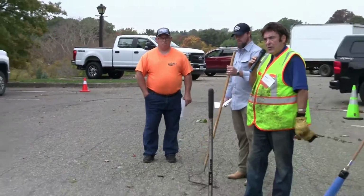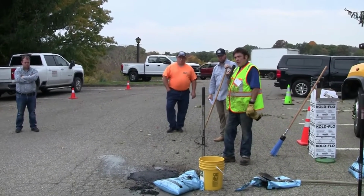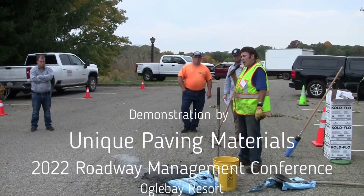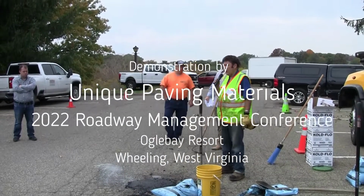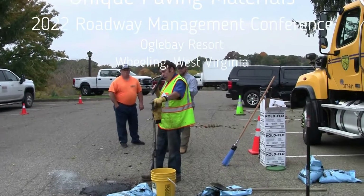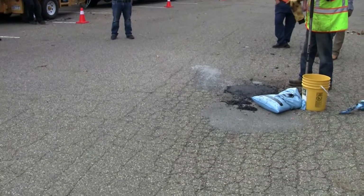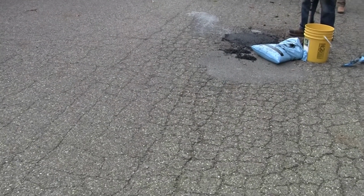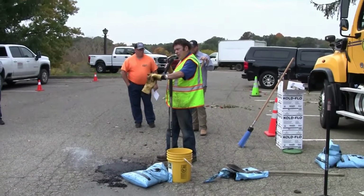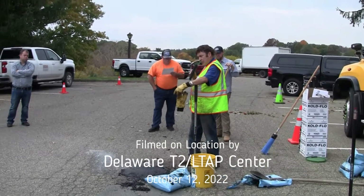Questions on workability, finishability, survivability. For those that want, I've got samples of the cold mix for you, a few bags. I've also got samples of cold crack filler, and also a newer product that we actually introduced that we were going to present earlier. When you get alligator cracking like this pavement here, we've got a material that will actually waterproof all those little fine cracks. And you put it down like a sealer, but unlike a sealer that just sits on the surface, this material will actually go in and fill all those nooks and crannies and waterproof those materials.